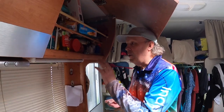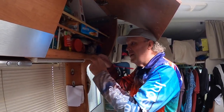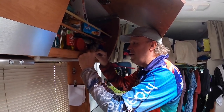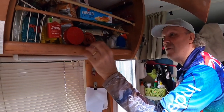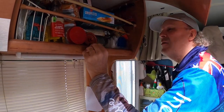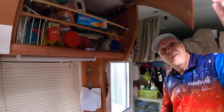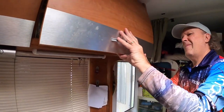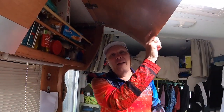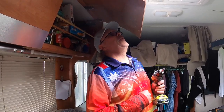That's on nice and firm. The challenging part is lining up the latch and the clip. What I'm going to do is put the screws in and attach the plate onto the latch — you can see the screws sticking out. If I make sure those screws are straight, I should be able to close the door down and give it a bit of a bang. That will leave two impressions here, telling me exactly where the screws need to line up. I need to make sure I don't go all the way through to the other side.